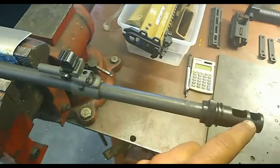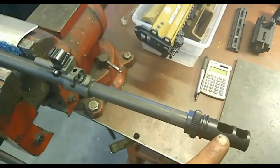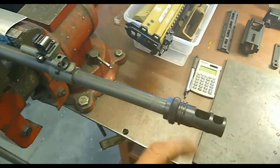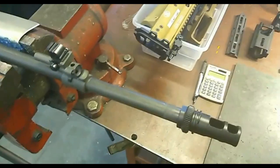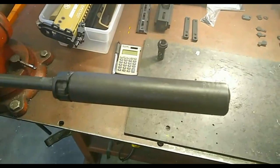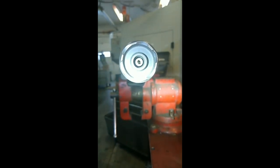I was able to achieve the desired pretension prior to cranking this down. Since I don't have an AAC suppressor in house, I'm going to mount a Surefire muzzle device and a Surefire SOCOM 762 to this barrel to verify concentricity. We've got the Surefire muzzle device and the can mounted to Nick's barrel. I'm going to take a look down the bore — it's about as concentric as you get. Good to go on this. Going to mount his muzzle device down, crank it on, do a secondary check, and then weld it up.